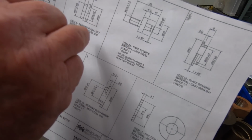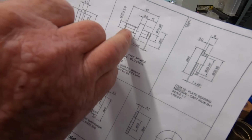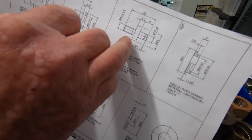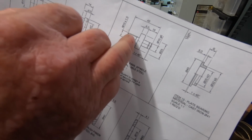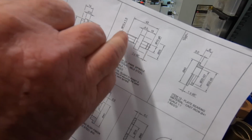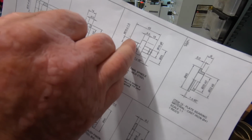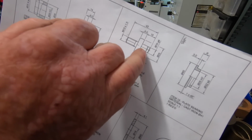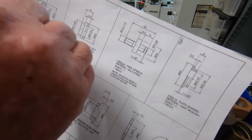It's going to be a quick job. I've already got the material down to 25mm in the lathe. It's just simple turning on the outside to get it down to dimension, just a piece of scrap steel. So we'll do this thread on the end first, part it off, put in a collet, hold it by this end and machine the end where the ratchet pawl actually sits with a circlip groove.